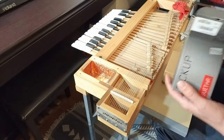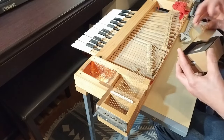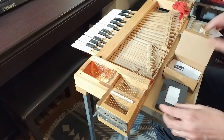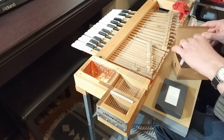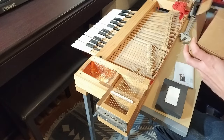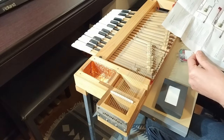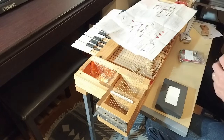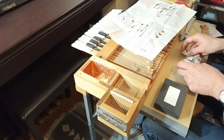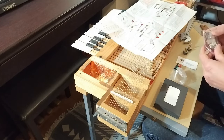I realised that with a guitar there is a vague hum, but most of the time you're in contact with the strings, and the strings are grounded to the electronics. But when I put some EMG pickups in my bass, I realised they recommend disconnecting the grounding wire. So this idea of touching the strings to mute the buzz isn't necessary with active pickups. Plus, EMG pickups are solder-free and I'm so bad at soldering, so I was quite attracted to the idea of using them.